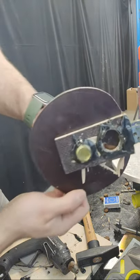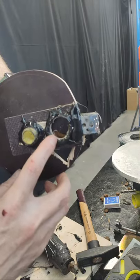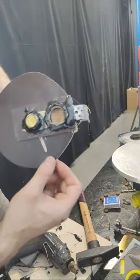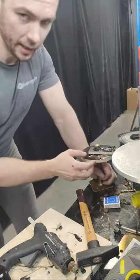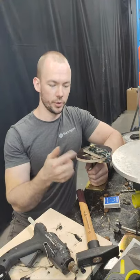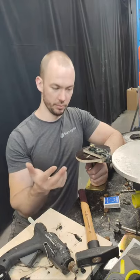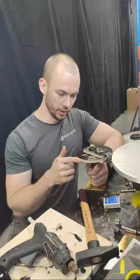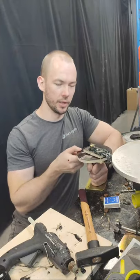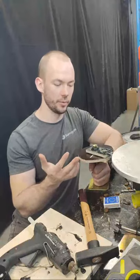So you can see when the dog food is sideways, it's jammed up against the edge there. So then you have to rotate back or crush it. But then you need like a powerful enough servo to keep crushing. And the thing is, we don't have feedback. If we just had a servo there, there's no feedback to know that you had a blockage. So the servo might start turning. You're probably just going to have a turning servo. This isn't going to move, and then it's going to rotate back. And someone misses their turn. And it's going to keep doing that over and over until eventually somebody's turn loosens the pellet. So like right here, I have it jammed, rotate back, rotate forward. So the second player there would have actually let the dog food come out, and the first player would have had a turn where nothing came out.